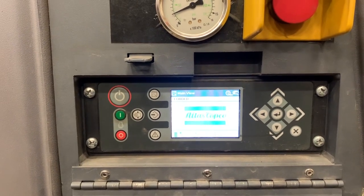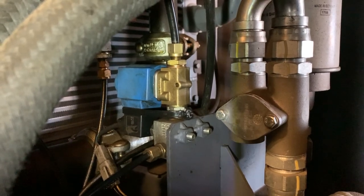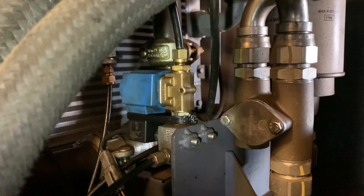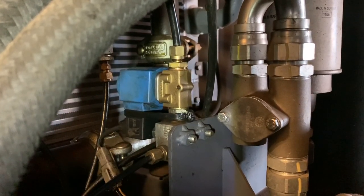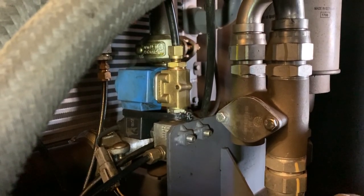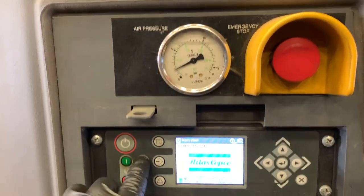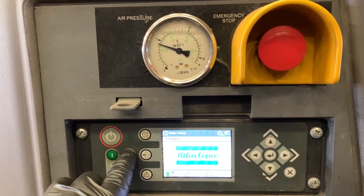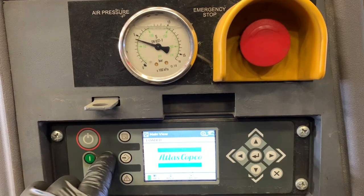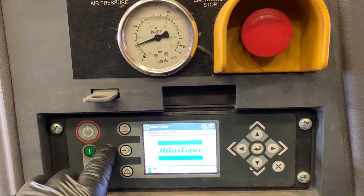What causes it to load and unload is a solenoid valve — I'll show you that in just a second. As you can see at the bottom there, I zip-tied the coil because I thought the valve was faulty at first. But when I was triggering it, what would happen is the coil, when engaged, would actually slide forward and say it's loaded — but it wasn't. If I held it in place, I could load and unload it. So I put a zip tie on it, and now I'm going to fire it back up.